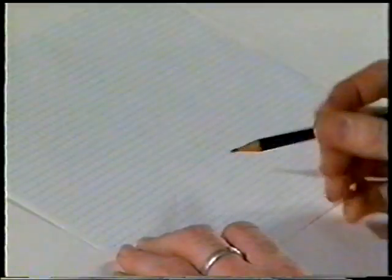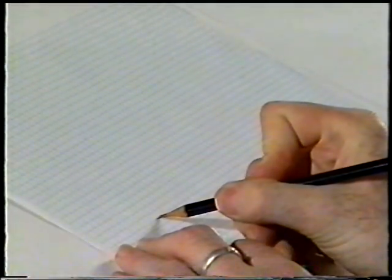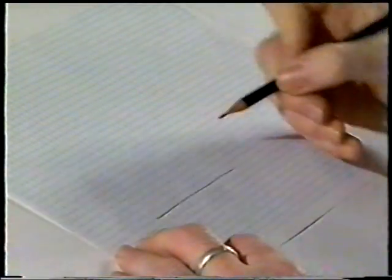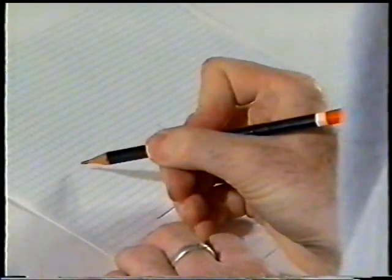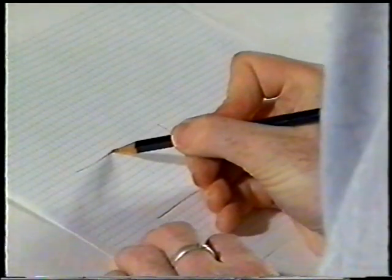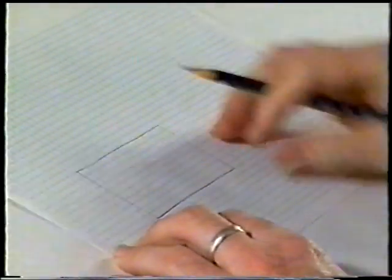Like isometric drawings, oblique drawing has a standard start. But for oblique drawings, it's a rectangle. Draw the overall height and length of the side that will be drawn parallel to the page. Obviously you'll choose the side that best reveals the true shape of the object, where there's the most detail.